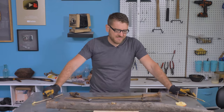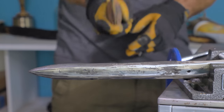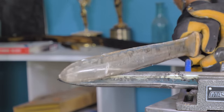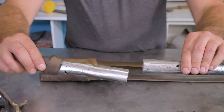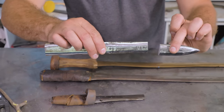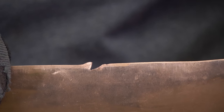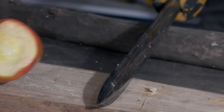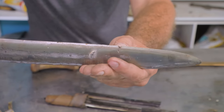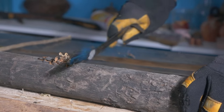Let's see how it would turn out in a real-life battle — see if it could even deflect a shot or if it's just going to break. It's going to be a bit shorter now, which might actually improve its odds quite a bit. Let's give it a whack with bronze. That held up actually pretty good. Now forge. All right, that took the tip off of it. The cast iron, as kind of expected, did break pretty easily. It was able to take some decent blows and deal some decent blows, but it broke relatively quickly compared to everything else we've done. Not the greatest material for a sword — if you have a choice, you're probably better off sticking to bronze. Bronze is a little bit softer but has that bendability so it won't just snap and break on you in battle. As a cutting tool it's pretty strong — probably would cut a lot better if it were a bit thinner. The strike I did put onto the forged sword did leave a pretty big dent — much more than any of the bronze ones ever did. So you're going to get a harder strike with this sword, but it's more likely to break on you.